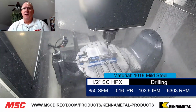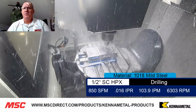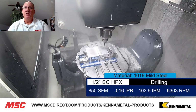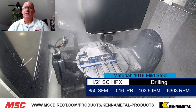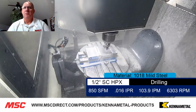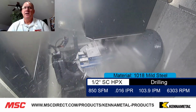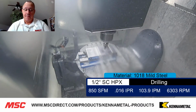One thing we didn't talk about: a lot of times when you run a high-speed steel drill, you have to use a center drill. Well, with these precision drill points, the GOdrill and the HPX drill, unless you get into some really long length to diameter ratio, you don't need to use a center drill or a spot drill, so you eliminate that additional tool. But you can see we're moving through this pretty quick, 850 surface footage, 16 thou per rev, almost 104 inches per minute. And again, low thrust because of the drill point design, so it's easier on your machine, and it really doesn't take the power to push it through there like you think it would.